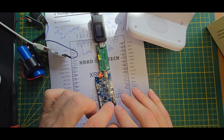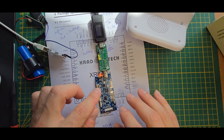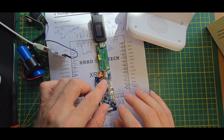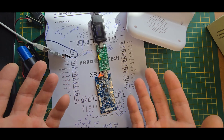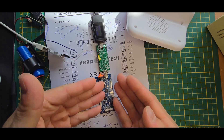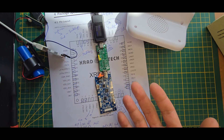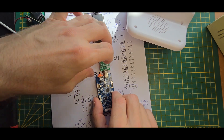It removes any over-the-air function because of its size, but you could theoretically just upload it via the USB plug. With the DOOM port itself you can also directly upload it without needing to bridge anything. The flashing is now done — you can turn it off and on again, and DOOM is running, but since we have no display connected it won't show yet.